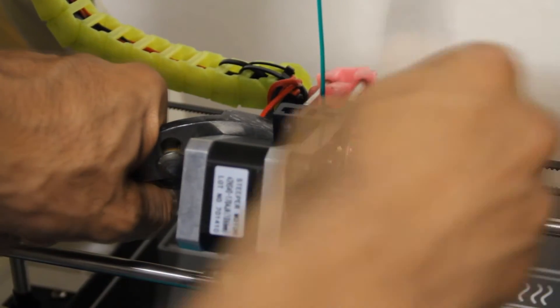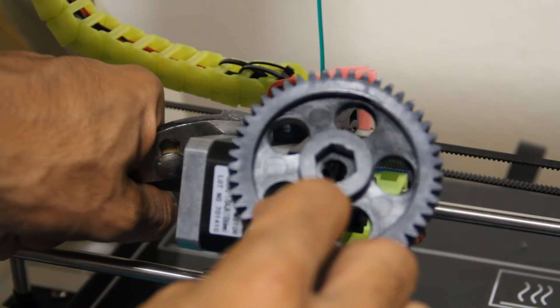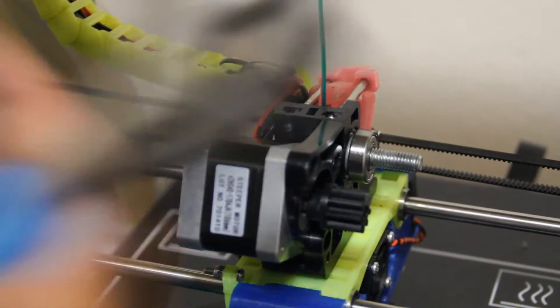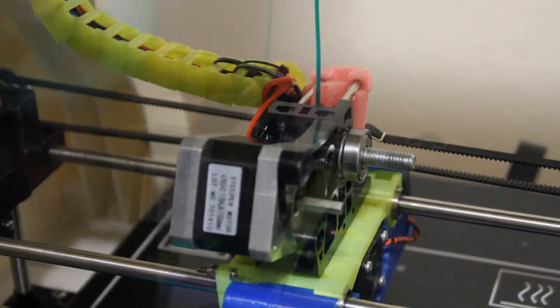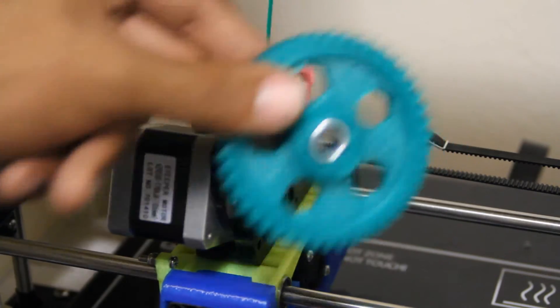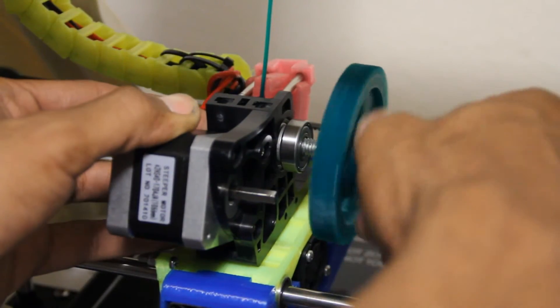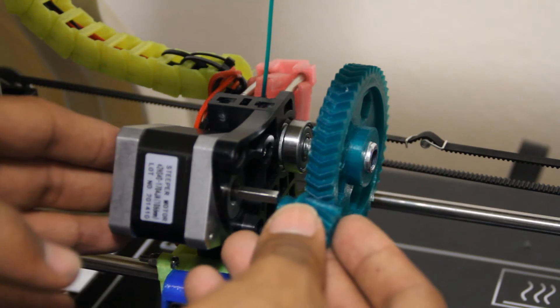Make sure that your extruder is not going to grind away at your cold filament. Once this comes off, the bolt will release and you'll have your old extruder gear. To get the other one off, same thing — take the pliers and just kind of move sideways and take this piece off as well. This model allows you to put the same nut inside the extruder gear, and you're just going to spin that back onto here. Same thing with this little piece — it goes right over the extruder.